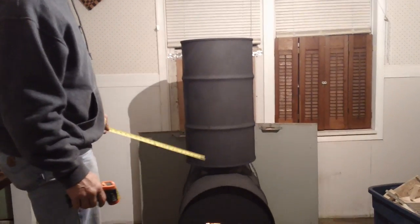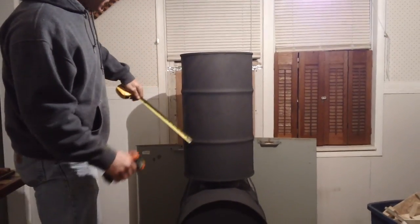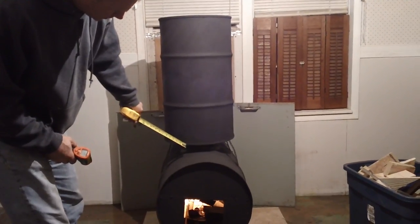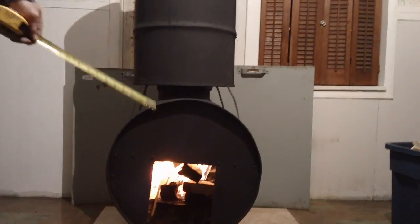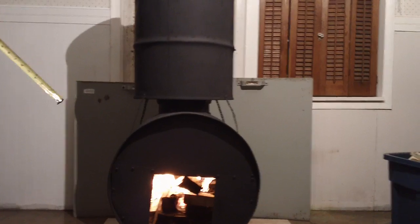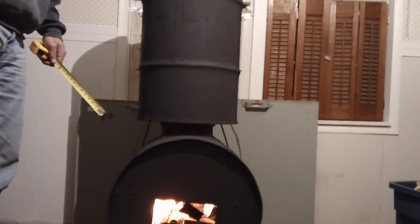There's an 8-inch piece of pipe inside this one that goes up right up to about this level. I just cut the hole in the side of the barrel and dropped that 8-inch pipe through there. That's what's called stove cement around that, making that seal. I put these connectors on there just so that barrel would sit good and straight.